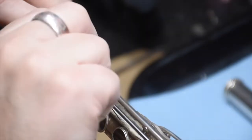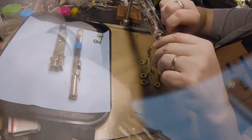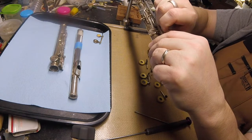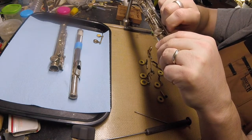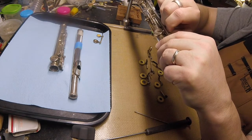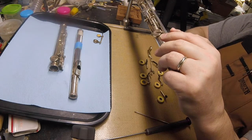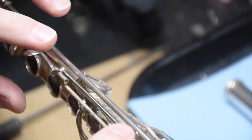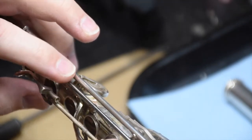At this point, if your fingers are small enough — I can barely get that with the drill key in the way — this is where you can really check the king post and see if there's any wiggle there. And that feels really solid, so that tells me any wiggle that I was feeling there before was in the key itself. So I will take care of that wiggle by fitting the key a little bit better on that hinge.